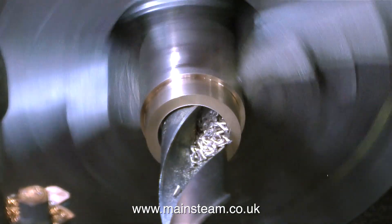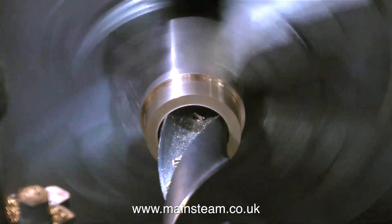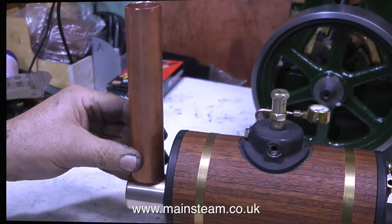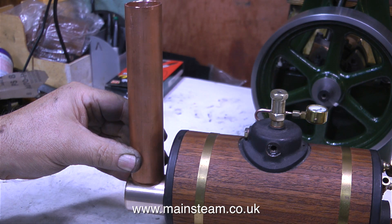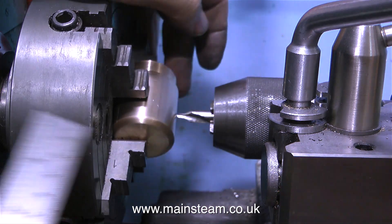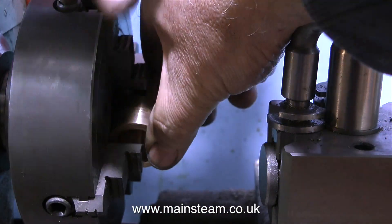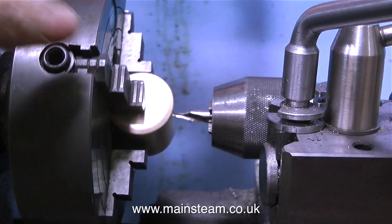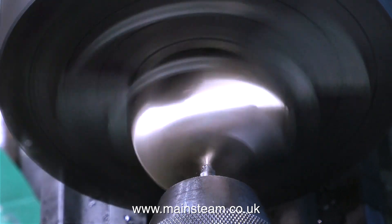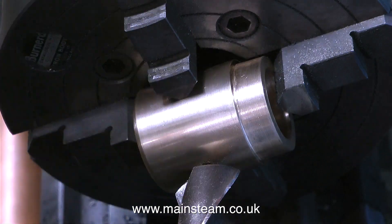I've just finished parting off the piece that I've machined from the main bar stock, and now I've mounted this piece in the chuck and I'm drilling it with a one-inch drill. If you look at this side view of the boiler with my adapter piece pushed into the end of the flue, you'll see what I'm going to be doing. In this clip, I've moved over to the Boxford lathe and fitted the part in the four-jaw chuck.